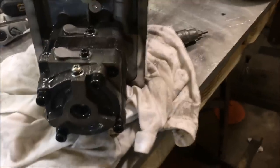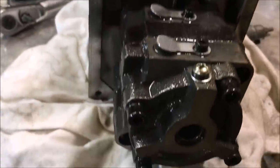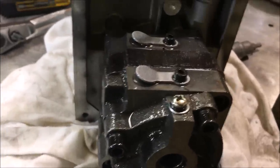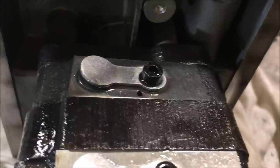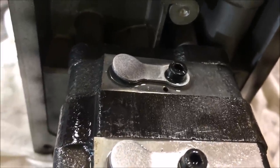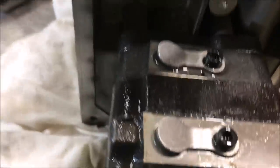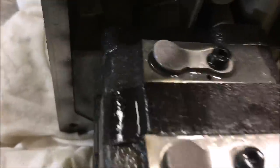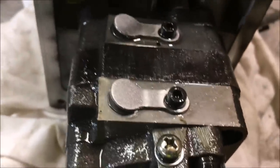I'm pretty sure I've seen it right. I might take it apart again just to double-check but I don't want to bore you guys anymore. I just thought it'd be cool to take this apart and see if it was in fact two-stage — and it is. They've added a clever second reed valve: during high-flow medium-vacuum scenarios when you're first pumping something down it can pump down a lot quicker discharging out of both vanes, but once flow rate decreases significantly only one vane is working.